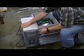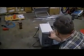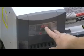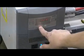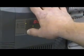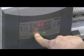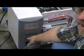When the batteries are plugged into the inverter unit and it does not have any AC power coming to it, if you turn it on, the display panel will automatically show you the amount of power coming out of the AC outlets. With the selector button, you can check the voltage on the batteries, select the output power — which is zero right now since we have no loads connected. Push the button again and you get the input power from a wind generator; this unit is pre-wired and ready to accept wiring from a regulated wind generator supply. Push the button once more and you see the input power from the solar panels. And if you were plugged into the wall, pushing it again would show the kilowatts being used from your wall outlet, and then the unit automatically reverts to the net power being supplied to the outlet receptacles.